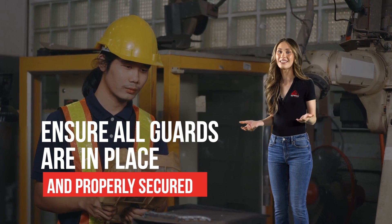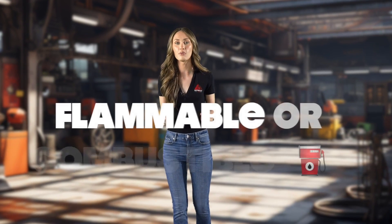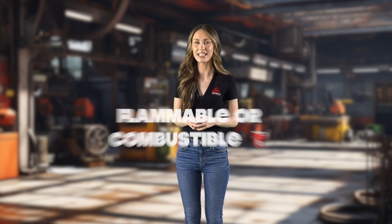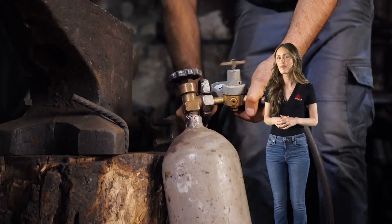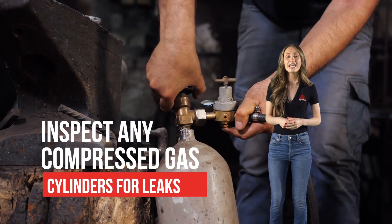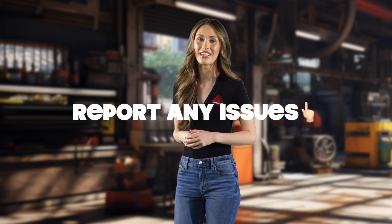Safety and warning labels on your equipment should be in good shape and legible. Ensure all guards are in place and properly secured. If any had to be removed for maintenance, make sure they're back where they belong before you start welding. Check the area where you'll be welding for anything flammable or combustible. If you can, move them away from your workspace following company policies. If that's not possible, make sure they're covered with flame-resistant materials. Always have a fire extinguisher close by. If required, set up a fire watch according to company procedures. Inspect any compressed gas cylinders for leaks or damage — if you find any, report it immediately and never use a leaking or damaged cylinder. Make sure they're properly secured too. If ventilation equipment is part of your setup, make sure it's working as it should.